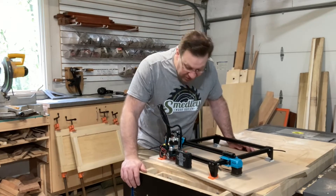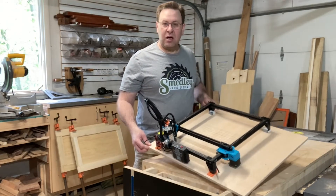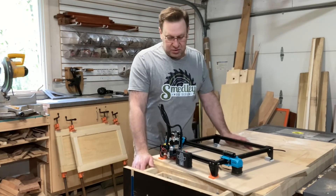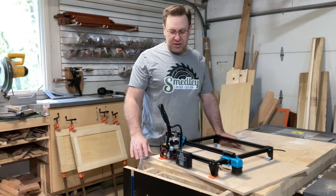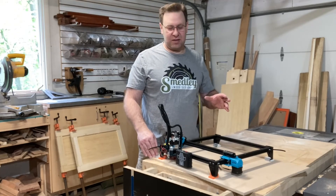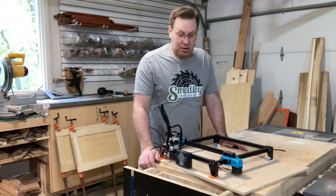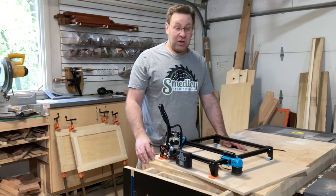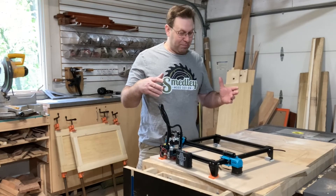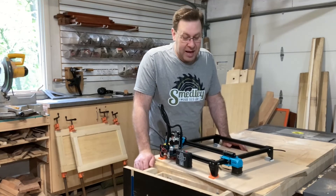It does home, and that's fantastic. I engraved a grid inside because I attached it to this baseboard, so I can gauge the size of my projects and line them up in the software. This laser is a little bit small compared to others, but for the price point it's not bad. It's 300 millimeters by 300 millimeters, which is roughly 11 and 7/8 inches square. Two Trees does offer an expansion kit to make the laser larger, but it's $90, which seems a little pricey. I wish Two Trees would offer this kit already packaged with the expansion kit — that way you're not just throwing away the original rails after expanding.